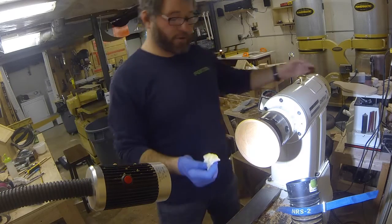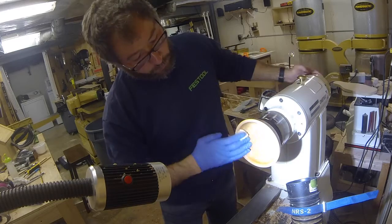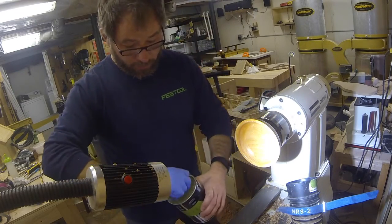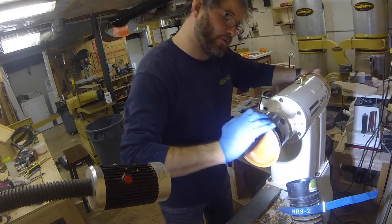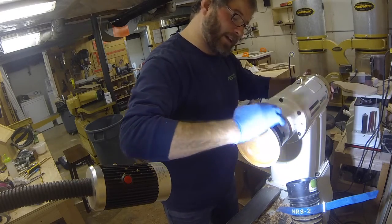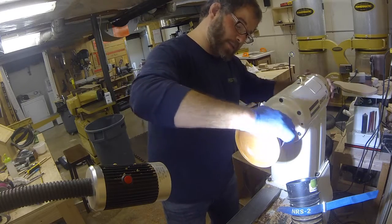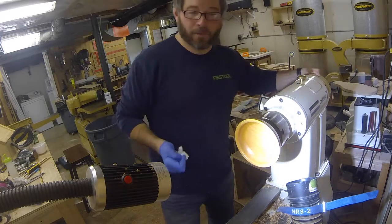The good thing about this finish is it's really forgiving, unlike a finish that actually creates a hard film. Some people don't like this kind of finish because it does require maintenance. I like it because for one it's natural — there's no heavy metals in it or anything like that, it's completely safe; the mineral oil is food-grade, laxative-grade if you want to call it that. I'll do the main part on here; I can't get the very bottom because of this chuck, but I'll probably do that tomorrow. I'll leave it on here so I can buff this first coat out while spinning a little bit, and then I'll do the bottom. Thanks for watching.